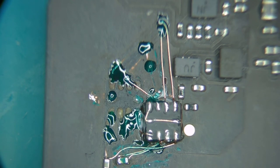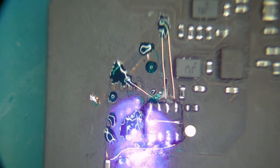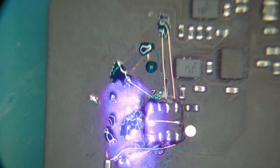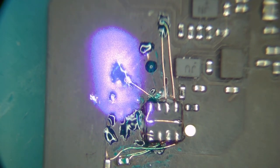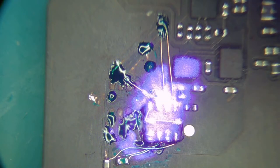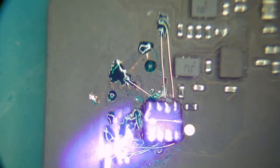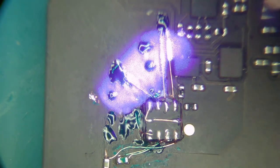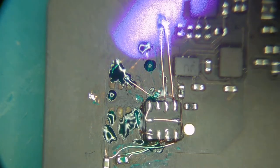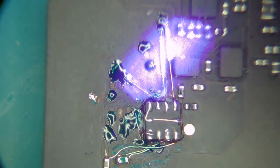Okay. Dim your eyes. Yes, the magnet wire is all enamel coated, but it is very small and very delicate. Any kind of abrasion will take it off. That's why I like to coat the wire where they're going over each other. I still like a little bit of extra protection. So this conformal coating will lock them in so that they can't rub on each other in any way while we do the rest of the operation.